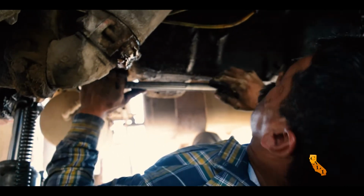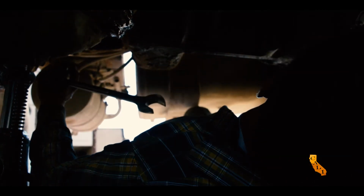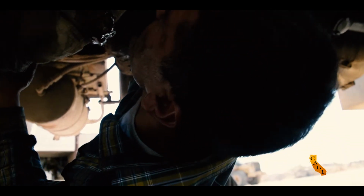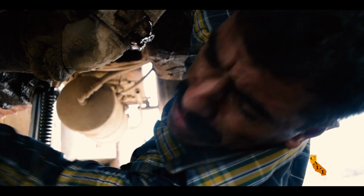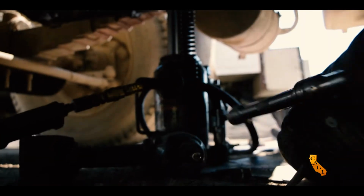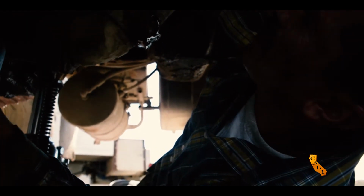The motor is moving up and down, and when they're trying to get it in gear, they're either stalling it or they might yank the drive line. So they just want to smooth out that first gear when they take off. The linkages on it are pretty bad. There's a lot of wear on it. I think everything just adds up. The clutch has been replaced already, but everything around it hasn't.